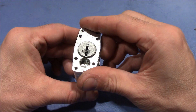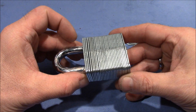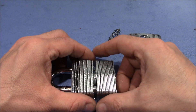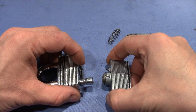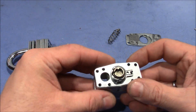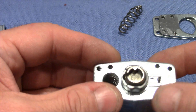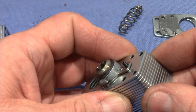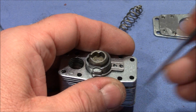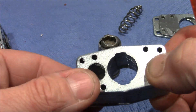Now we can see the chamber for the longer end of the shackle that's connected to the shackle spring, and we can separate the lock at this point. Here is the lower part — that's the stack of layers that hold the plug. The plug is secured with a clip, and the clip is pinned with a roll pin. Let's take the pin out — and now we can slide out the clip so the plug should come off. We can see three cutouts here.